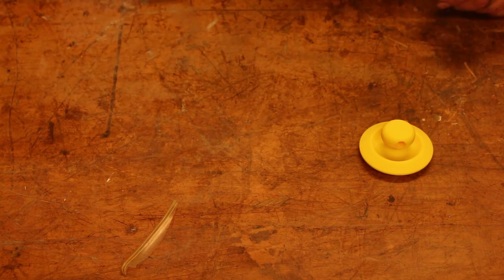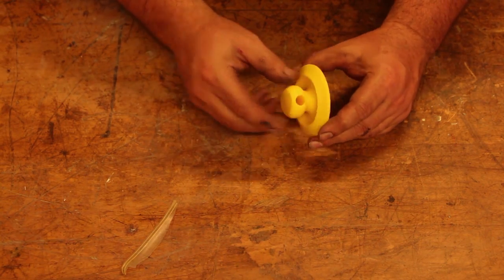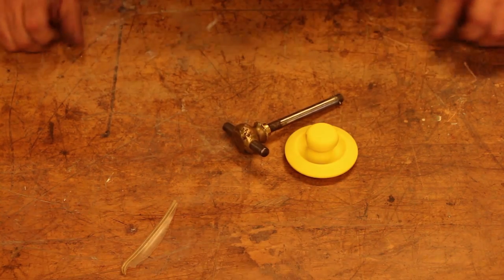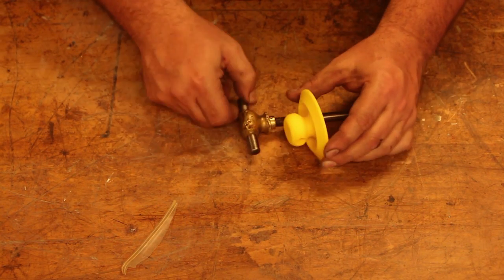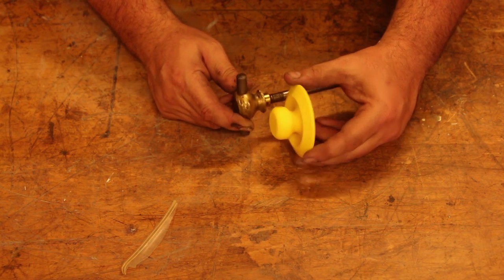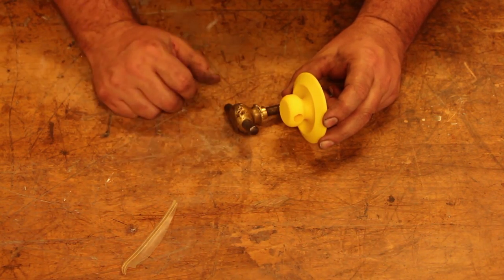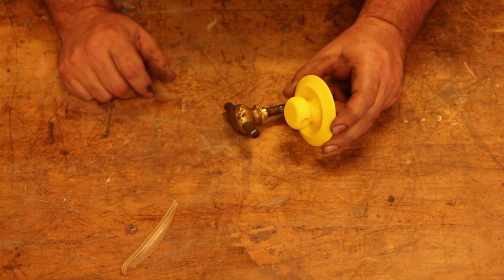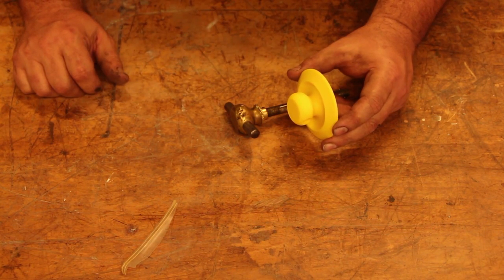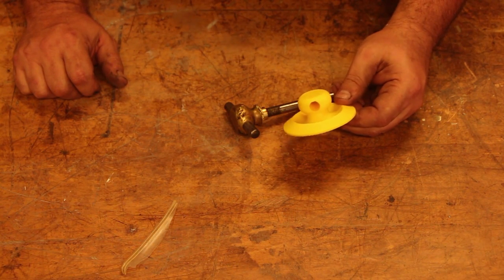So I sent Charles some pictures and some dimensions, and we came up with this. This is what the dial is supposed to look like. And let's see. Here's what's left of my original one. And if you look here, the profile on there of the two knobs is pretty much identical. Of course, it's got a hole here where that little steel piece would go through it. And you can see that the whole piece back here was busted off of it. And this is what I need to make. I'm going to have to turn one on the lathe and basically recreate this part. And originally my plan was I was going to turn it out of a piece of solid brass.